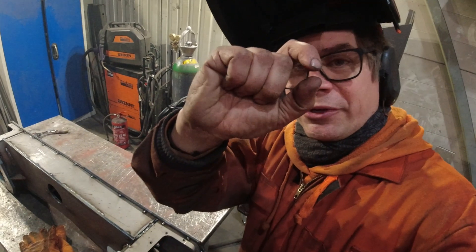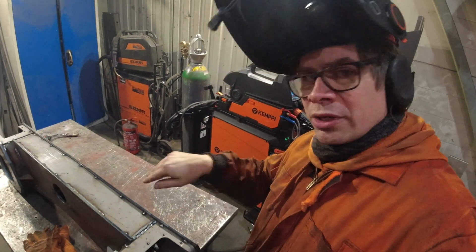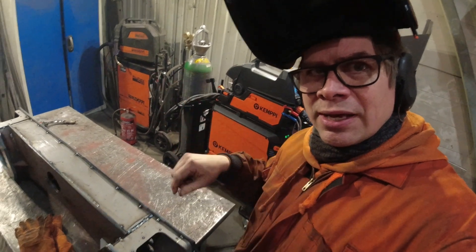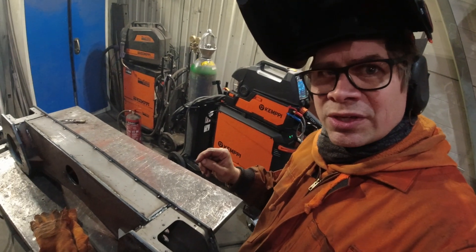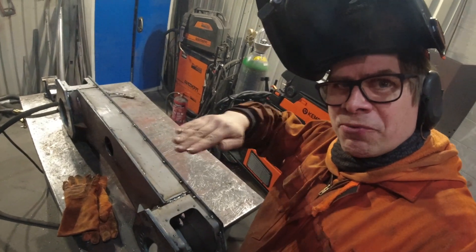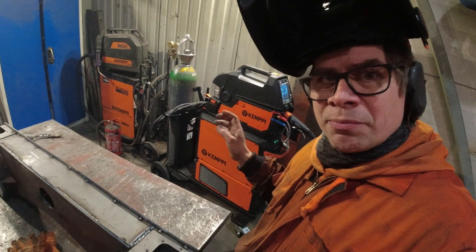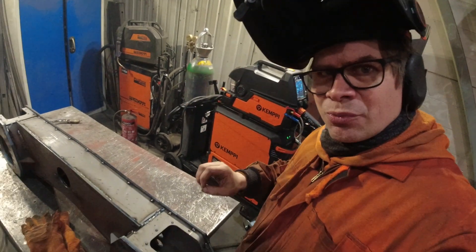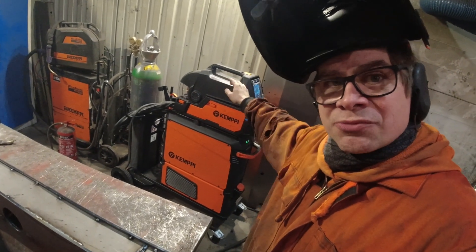There was a pretty wide gap for the welding. I didn't know if in the normal case it would have gone through. But with double pulse it was pumping, pumping, pumping — and it was filling it. These special programs are made for the mistakes. If everything were super simple seams in the perfect position, there wouldn't be any need for those programs. But when there is something special — like you have to weld in a strange position or there are gaps — then the programs are pretty useful for those situations.